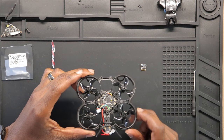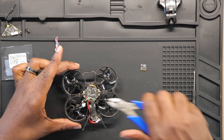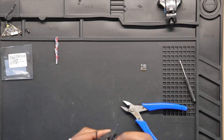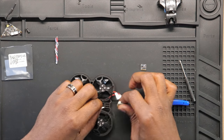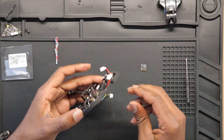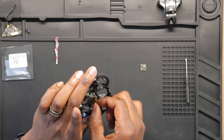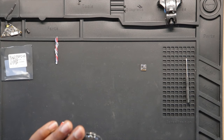It's time to start cutting. We're going to remove this receiver and install the new one in the same location. Snip it away — that's in the trash. Now that the antennas are free, the receiver is also free. I could just cut this off but it's actually a plug, so I can reuse this receiver on another drone. Although, since it's a FHSS receiver, probably not. I'm going to fish this wire out because I intend to reuse two of the four wires — the red power and the black ground. It's already done for me, so why mess with it?